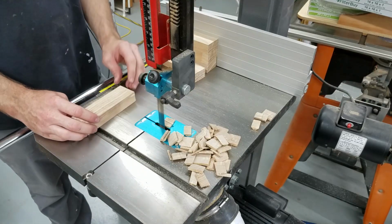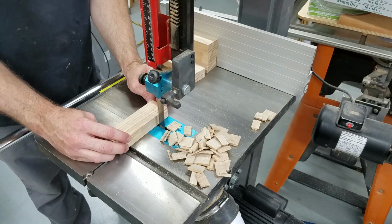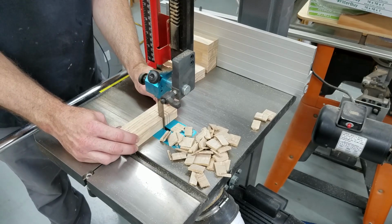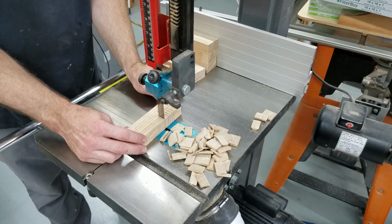I wanted to make sure this thing was durable, so I decided to use ash for the body and Baltic birch plywood for the cover. And the first step after getting everything marked, of course, was to go over to the bandsaw and do the rough cuts, just to knock out the majority of the waste. Then next it'll be over to the router table.